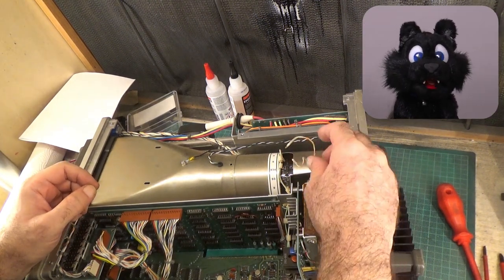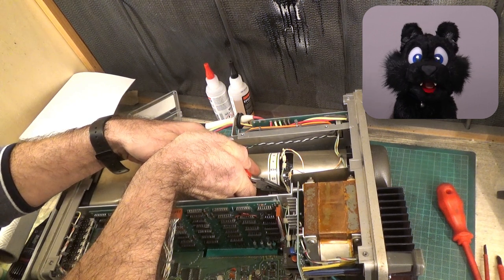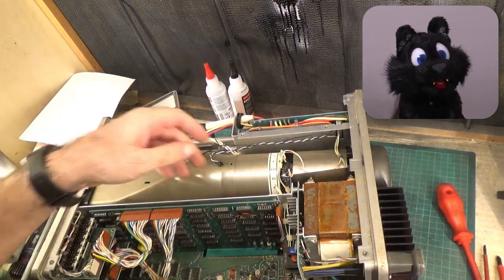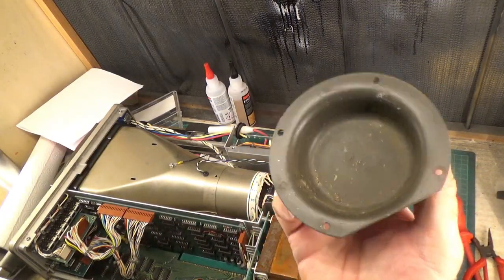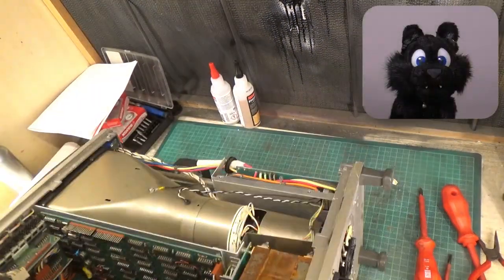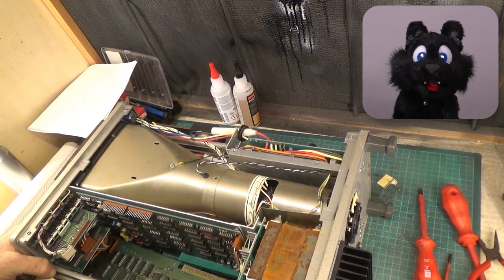Like always, sensitive parts come out first. In this case, the CRT is on the top of my list. The deflection pins are almost fused together and take more force to pull off than I'd like, but it seems that nothing is damaged. And every screw reveals more grime trapped inside. The boards are folded up and stacked like some of the best, or worst, PCB origami I've ever seen without resorting to flat flex.